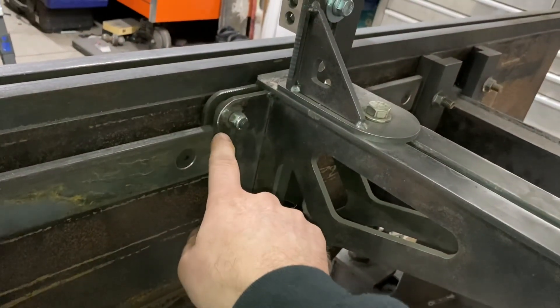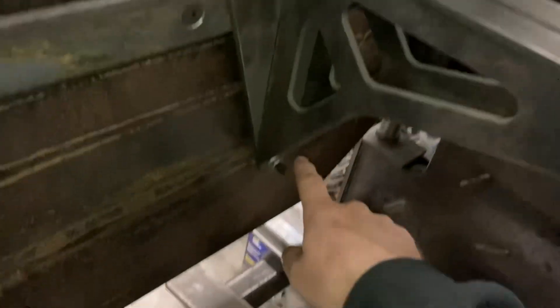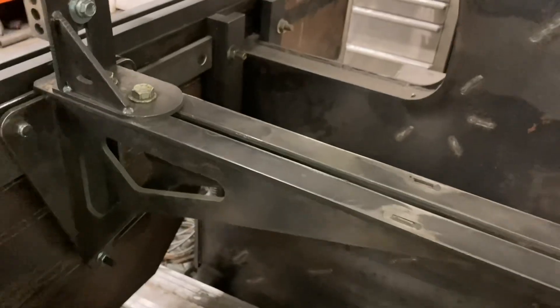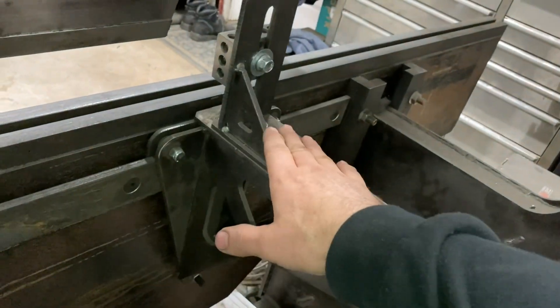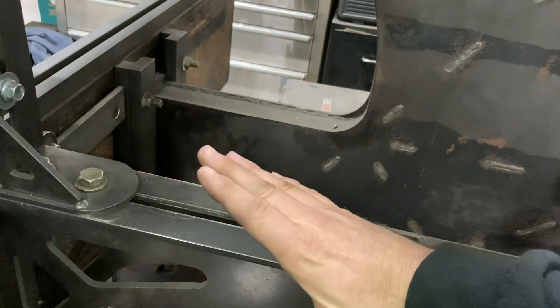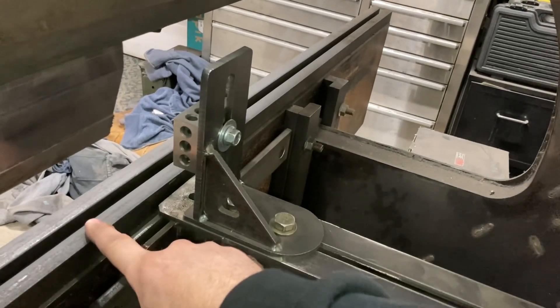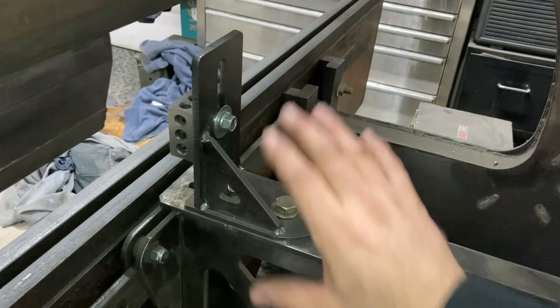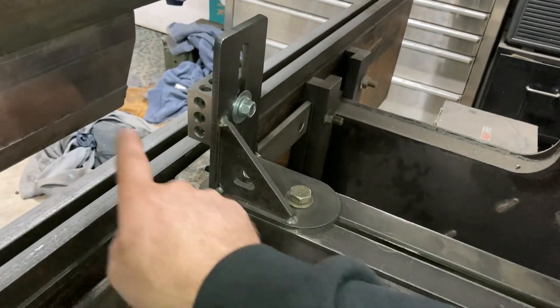It's got a pretty tight-fitting gripper that reaches around that rail. And down on the bottom there's an adjustable standoff. I can run that bolt in and out to square this to the machine — so that if this was crooked, this vertical surface would not be vertical to the die set, it would be tipped away. With that adjuster I can make sure that this is a consistent distance over its height from the center line of the dies.